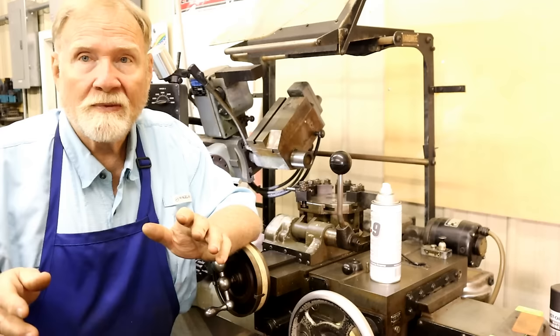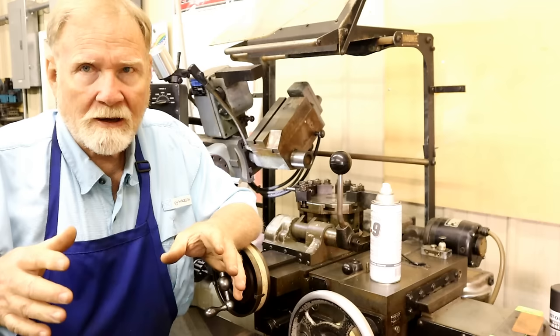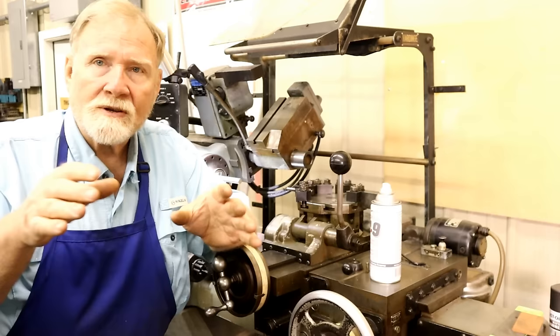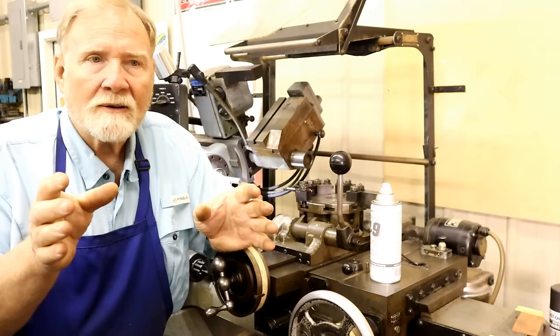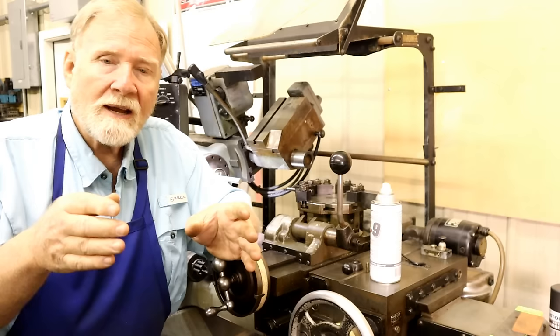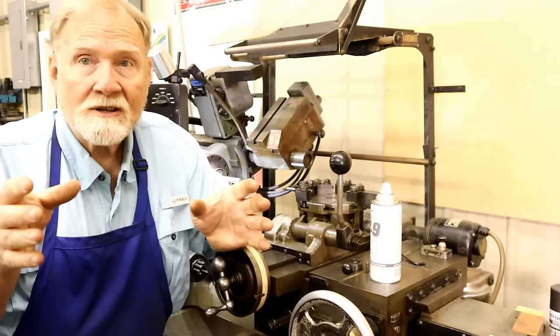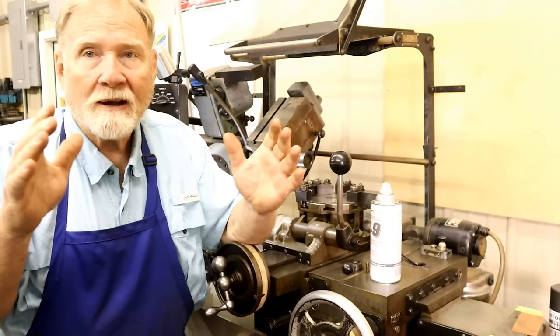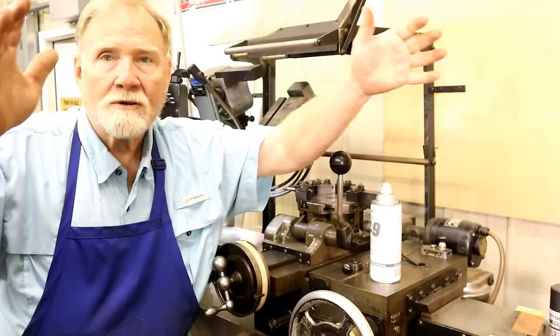The pattern was made out of wood, and frankly, it was made in one way, and I think it was kind of like a prototype. Here, you pour this, and this will get you this. But the problem was the outer ledge for the cores made the pattern about 5 to 6 inches wider than the actual part, and then you had to have sand on the outside of that, 3 to 4 inches of sand to take the heat. Well, man, you got about a 14, 18 inch cast right here. Now you add 6 more inches, then you add 8 more inches, and pretty soon you run out of camera space to show you how big it was.